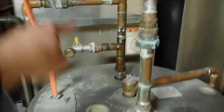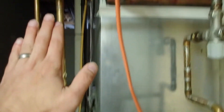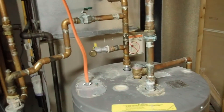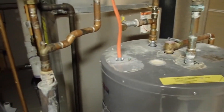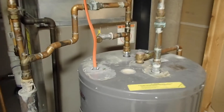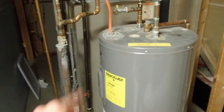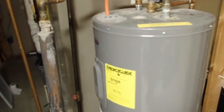Luckily, I was able to shut this valve, and hopefully we'll have hot water using the electric hot water heater this winter, just using the boiler for the furnace. This is a new development, so I'm still anxious. I'd like to get it replaced, but we can't do that because we need the heat right now — we're getting closer and closer to winter. I'll try to post some photos of what this install is supposed to look like and some information about what you're theoretically supposed to have up top with this type of water heater. I found all this out by coming across a product page for a sidearm setup and found out that this was completely inaccurate — it's completely installed wrong.